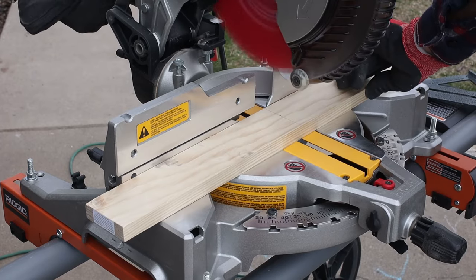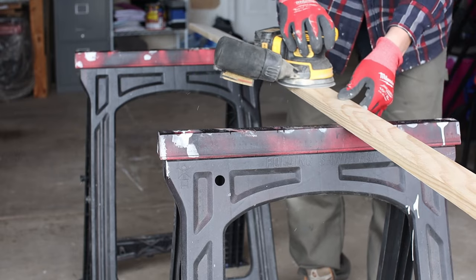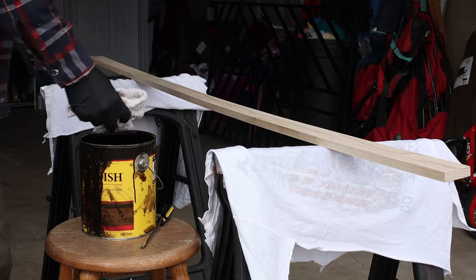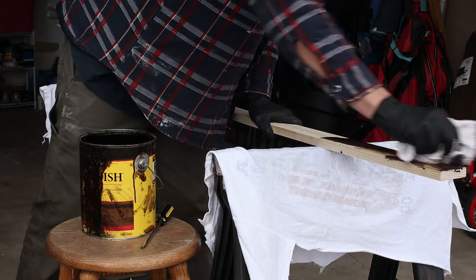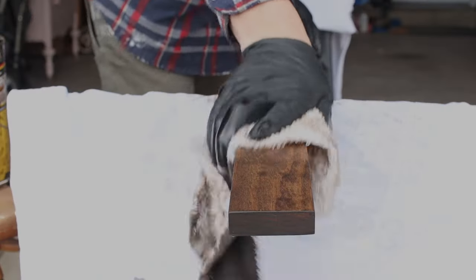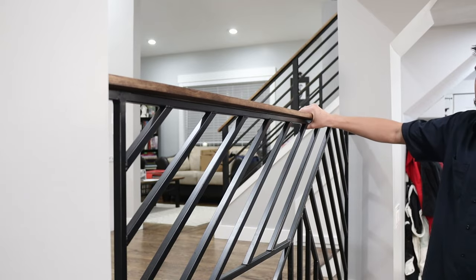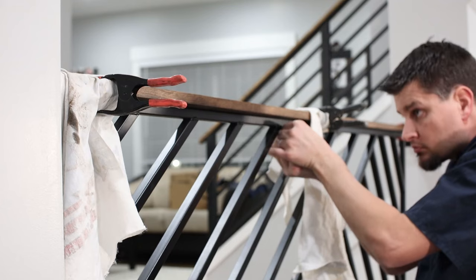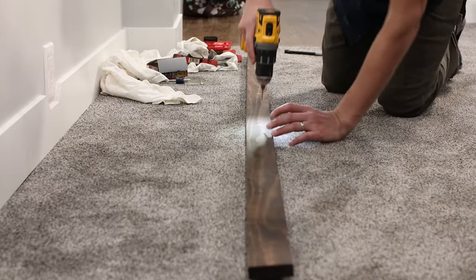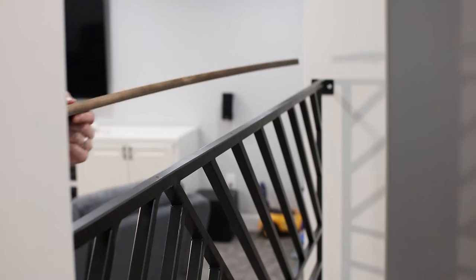We still have the top rail to do, and I went as cheap and simple as you could get — that is a one by three pine board. Back when I got it last year it was like eight to ten bucks, so who knows now. All I did was cut it to length, gave it a nice simple sand, and the stain I was using is Minwax Espresso. If you took note of my beautiful new floors, that is the same color I used for my hardwood floor, and the railing does match the floors and the railing for the stairs as well. To attach it I pre-drilled some holes through the metal railing, stuck a little drill bit up through it to mark the wood, did a little pilot hole so it wouldn't crack, and then screwed it from the bottom up through to the top.